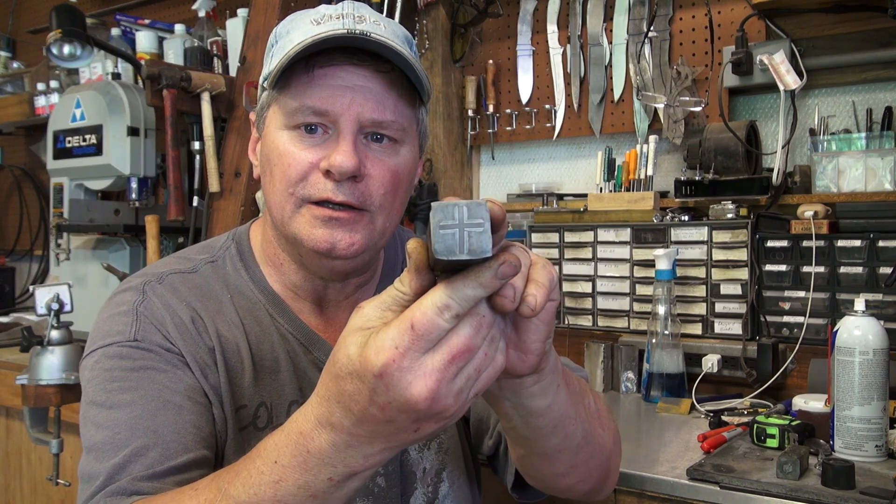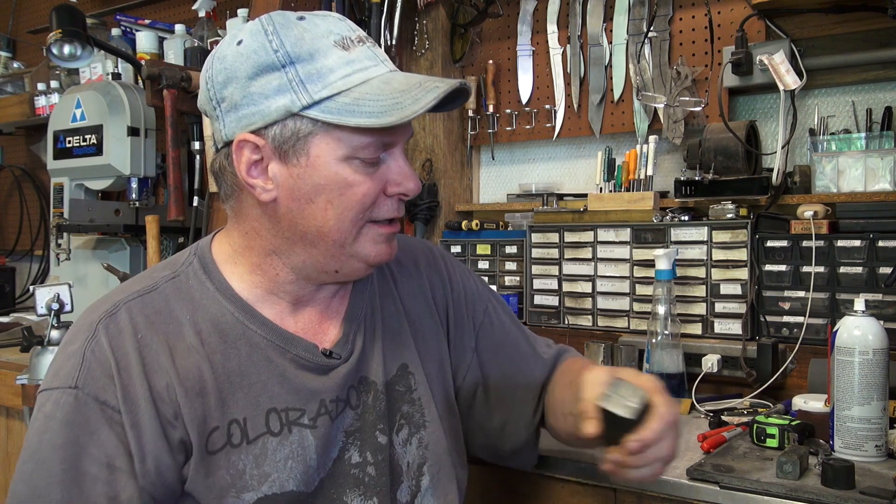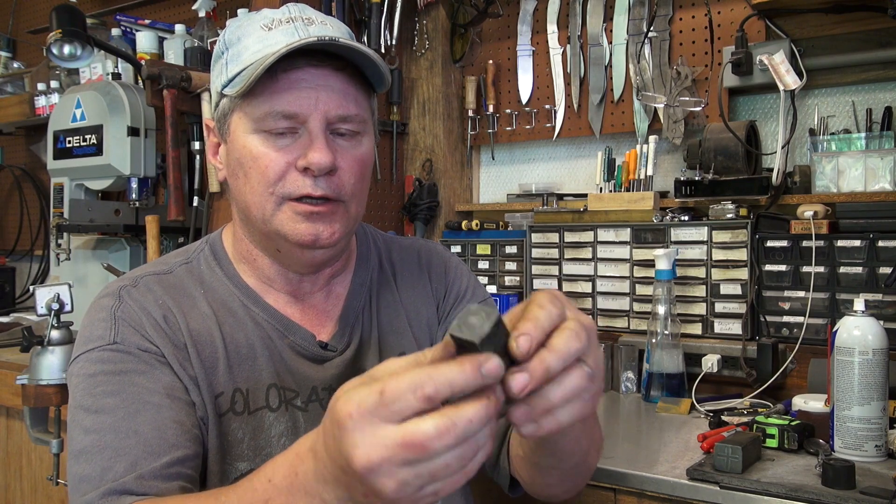I saw Steve forge one and it just fell out too, and he's using the foil. So I know there's something there, but for me the stainless can was just unbelievable. Tim with Big Dog Forge is where I got the idea — seen him do it. You can get thin wall stainless tubing; it doesn't have to be thick, that stuff is tough. And there's the pattern — the cross I put in there. I didn't cut quite deep enough to reveal the complete pattern, same with this random pattern with springs and some junk in there.